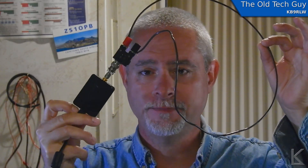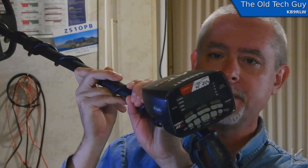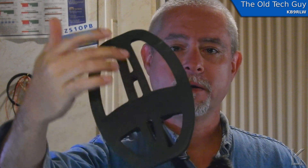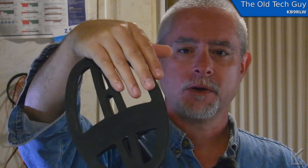What I did was make up a little pickup loop for the HF Plus. For a signal source, I have a Garrett AT-Max metal detector, which operates at 13.6 kilohertz — right down in that range. This is the coil on the end of it. It's a double D coil, meaning there are actually two coils. One is a transmission coil and one is a reception coil, and it generates a signal on the one coil at 13.6 kilohertz. I don't know if it's modulated — that's another thing I want to find out.